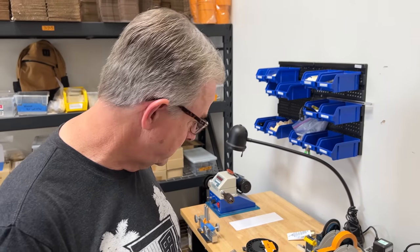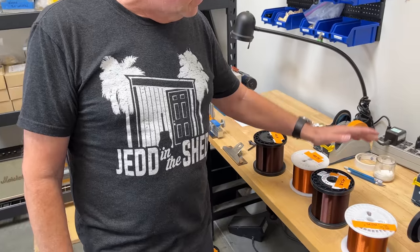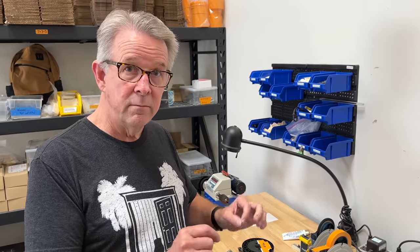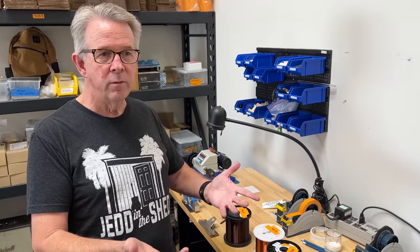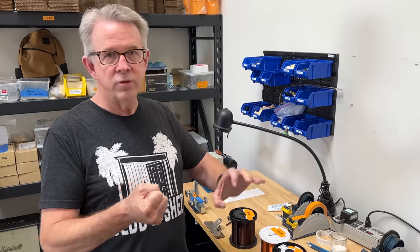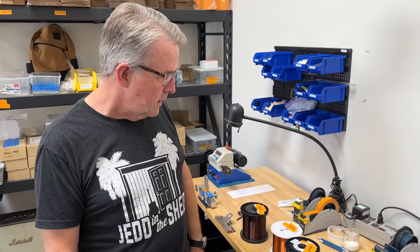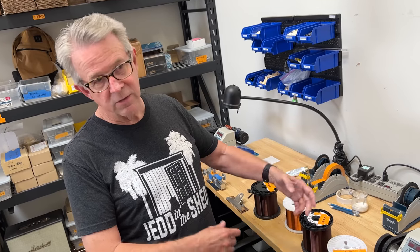With all of these suppliers — you get, say, ten six-pound rolls, specified to a particular diameter min/nom — as you go through the spool it changes and goes out of tolerance. You have to compensate because if the wire gets thin and you put on the same number of winds, that pickup will be hotter. When wire gets thinner, it's like shoving high-pressure water through a smaller pipe — pressure goes up. We package up out-of-spec wire and send it back to the manufacturers.